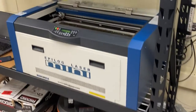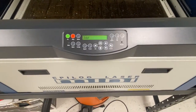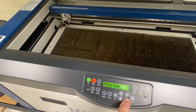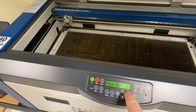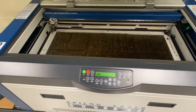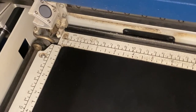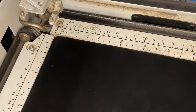Alright, we're going to make our way over to the laser engraver. It's important to turn it on and make sure it's running for a few minutes before we start our project. Once it's on, we can change the depth of the laser by pressing focus and then the down arrow. If you wanted to cut something thicker, like a box or some thicker materials, you don't want the laser hitting it, so we're just going to drop the laser down just a little bit to set up our project. We're going to reset it and now we're ready to go. We're going to place our material in the top left corner of our engraver bed, ensuring that it's nice and snug. That's like the zero-zero top left corner of your artboard, so the tighter the fit, the better the print.